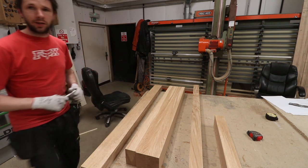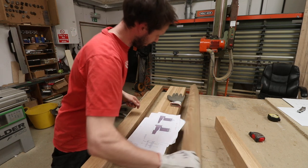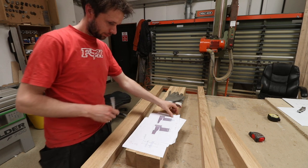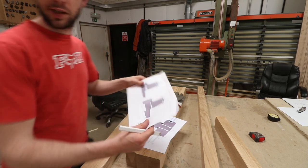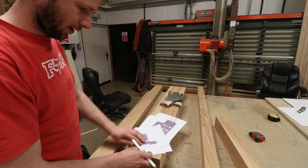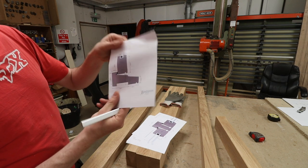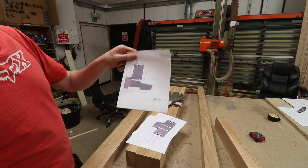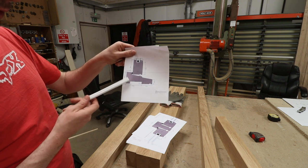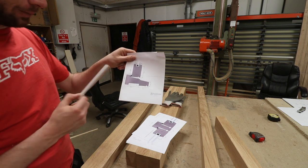So we'll go back to the cross-section drawing. We're going to use this piece as the head. Let's use this one as the sill. So we're looking at a sill here. Let's fold that in half because we're not using that bit. I'm going to add a piece of timber on my sills like this, underneath, a half inch strip of timber, just to make that 58mm timber a bit taller, so it gives the appearance of a 3-inch sill.